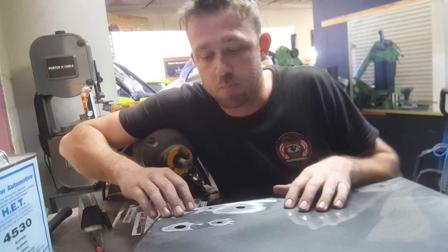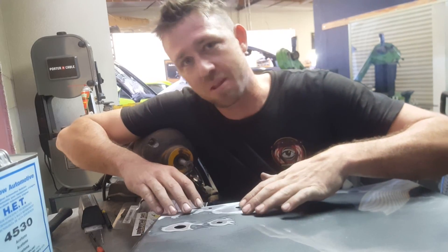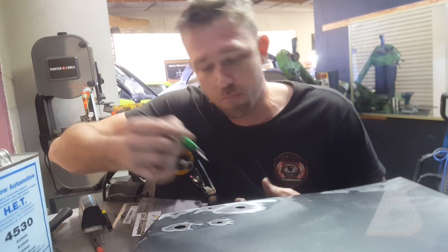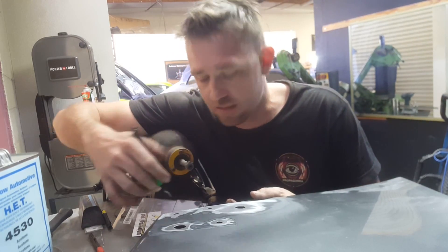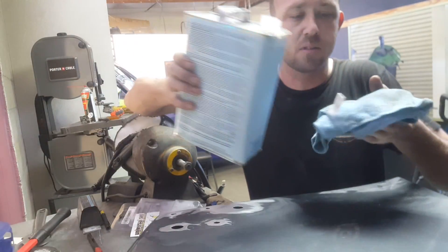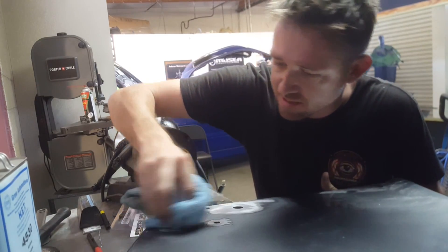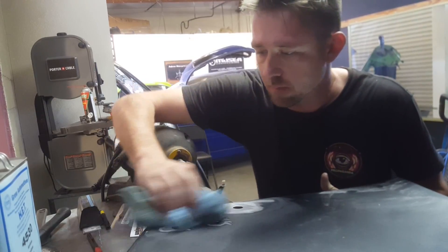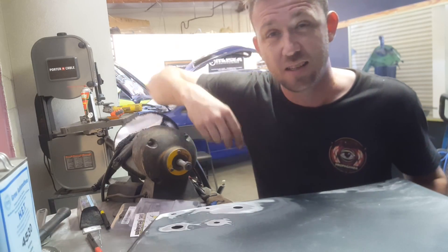Preparation is key to ensure that we get cooperation with this metal. Because this trunk is so thin, it's going to want to warp and distort. The grade of aluminum used is usually not top of the line — it really just has to be aluminum. Aside from removing the paint around the holes, I'm going to take a deburr tool and scrape the inside of the holes to clean out all the paint and debris. Next, we'll take a rag with some acetone to make sure the aluminum we're going to weld is nice and clean. Now it's pretty much ready to weld.